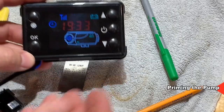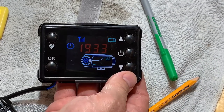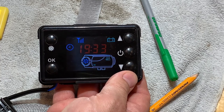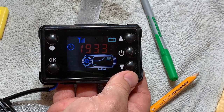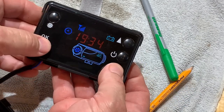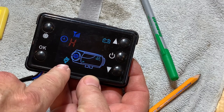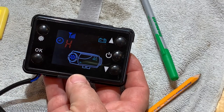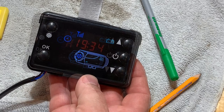The next thing I need to do is prime it. You'd only need to do this the very first time you've never used the unit before. My experience is telling me that if you can get the fuel in the line either using gravity or suction, go ahead and do it — because until this pump has diesel in it, it's running dry. Diesel is a lubricant. To prime the unit for the very first time, press these two buttons here together, then up. The pump is going — you can hear it clicking. If you're doing it for the very first time, the best thing to do is go out and physically look at the line and see if you can see the fuel coming up to the unit.